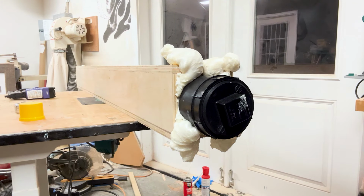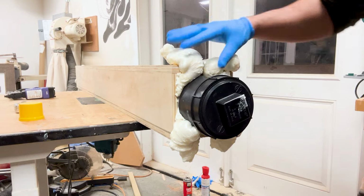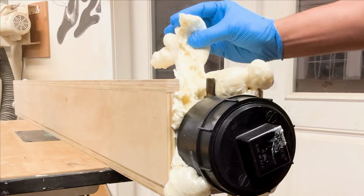Huh. Well, it worked. We're insulated. Now I just gotta kind of make that accessible again. Naturally, on the coldest day of the year, I would want to be outside steaming wood. That makes sense. But whatever. I have pre-funked my water in here with a tea kettle. Just heat up some water, put it inside, then you can add normal water. It really does help get your steam box up to speed faster. Saves you a lot of time.